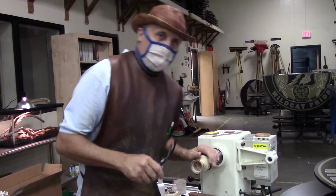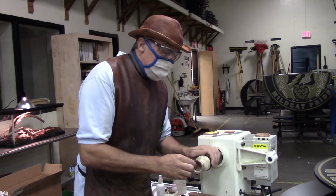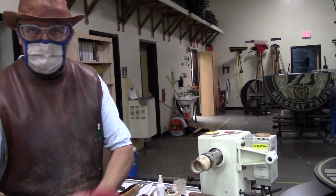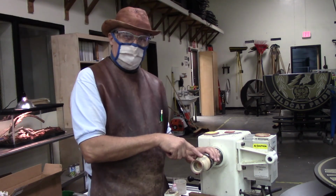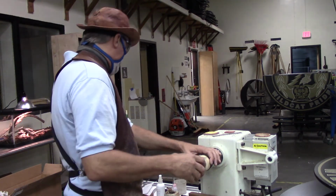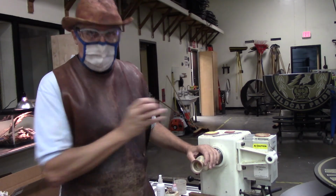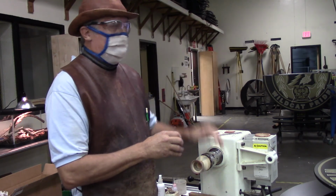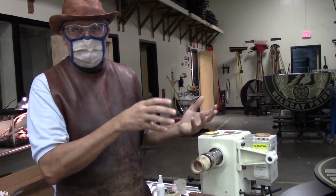Yes, sir. On those first 4 that you passed around, you said, well, I'll chuck this up and put some turquoise on this one. How do you chuck that? Well, I would put a block on like this, turn a little recess that the bottom of that fits into, and I would glue it into place. Okay. And then just recut that wood off the bottom. There's finish on it, so the glue is not going to soak into the wood.